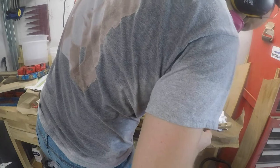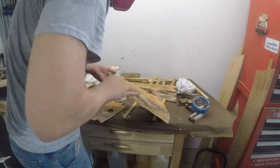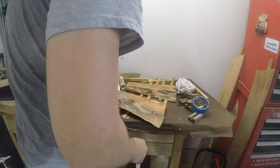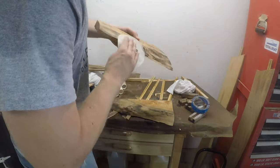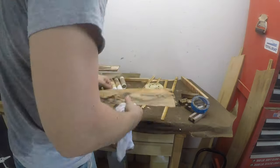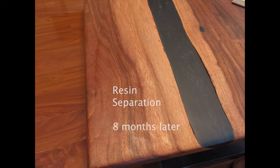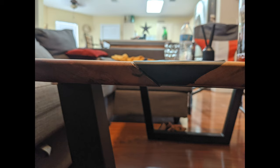Something very important: you need to come back and sand off that exterior layer of shellac from where you want the resin to actually stick. I've seen two schools of thought from very well established businesses on how to handle air bubbles. One is doing it the way I'm doing here, and if you don't sand away that outer layer of shellac, the resin won't stick — I ended up with something like my coffee table after one change in season. Wood moves, period. No matter how much finish or coating you put over the entire thing, wood will move. The reason mine failed is probably a combination of resin not forming a good enough bond, but also the legs were screwed very tightly and bolted into the table, not allowing for any wood movement. The other method is to use a very slow drying resin — something that takes one to two days before starting to solidify — which gives the resin time to seep into the wood, release air bubbles, and let them rise and pop.